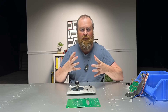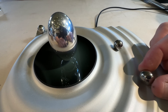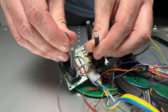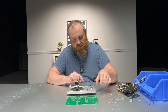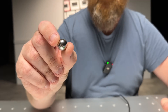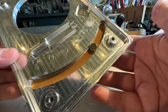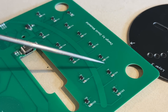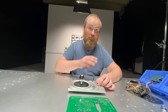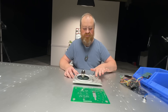So the design needed to reflect that - it needed to feel calm and interesting, and you want to be able to interact with it. Normally manufacturers just slap on some potentiometers, but that doesn't fit with the magical feeling. So what we came up with is balls - ball bearings attached using magnets. This has a magnet in a track with Teflon tape - the magnet moves back and forth, and we use a bunch of Hall sensors to figure out where the magnet is. It's basically just an analog slider with resistance but no stiction.